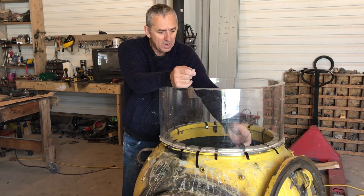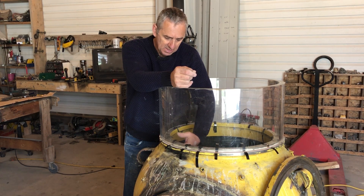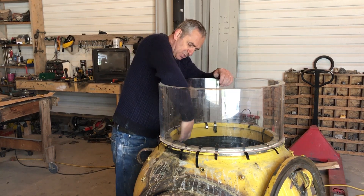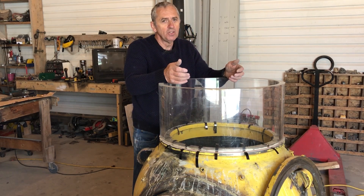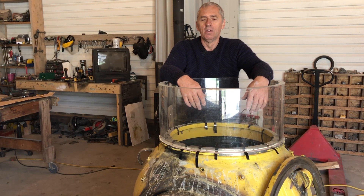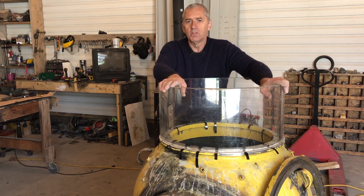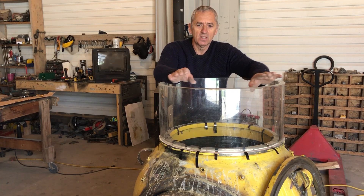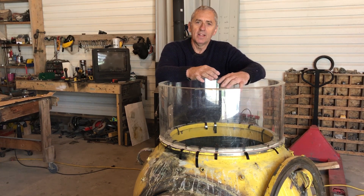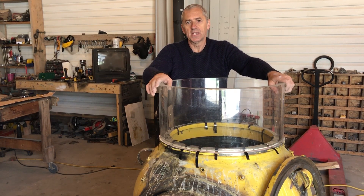I have it fitted so that when I pull on each one of these ribbons there is resistance. Some have a little less resistance, but that's to be expected — there's no way of getting it absolutely perfectly flat. It's definitely very, very good. Plus, this is going to sit on a rubber gasket; it's an unrestrained installation, which means this can actually float around. The rubber gasket is contact-cemented to the seat and then vacuum grease or silicone grease is put on the gasket.